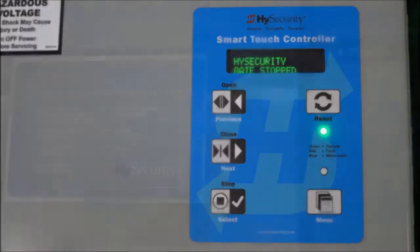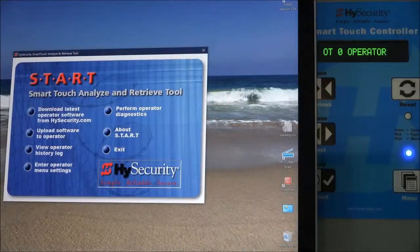All right, we've just installed the board, and we just re-entered those settings that we saved from the scroll earlier, the settings such as build year, operator type, the handing, and the usage class. But if we had previously saved those settings using the start program, we could reload those, and then we wouldn't have to re-enter them via the keypad display, and we'd be finished at that point.